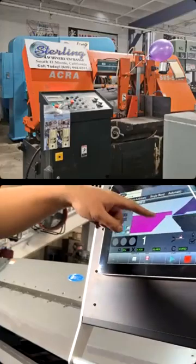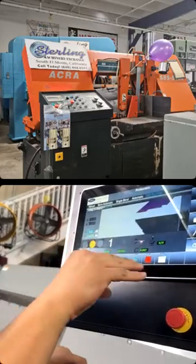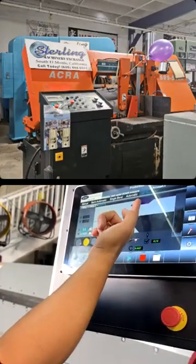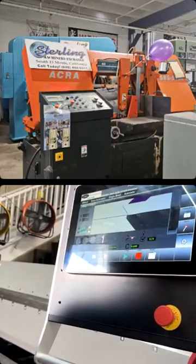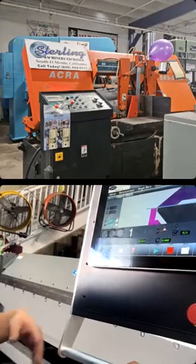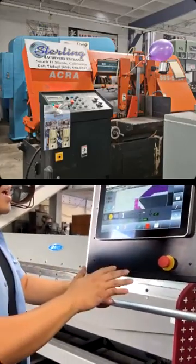As you can see right here in the simulation, it's 90 degrees. And now we're just going to pinch the hem down. So right here it's telling you exactly how to do it. You flip that piece towards over there, and then the table is going to crush down onto the piece of metal to create that hem. So you just press down. After you put in the piece of metal, it should be crushed or pressed down, and then you've got your hem after the piece is made. So that's a very simple 90-degree bend with one hem.